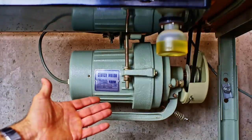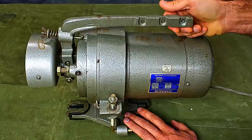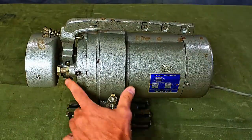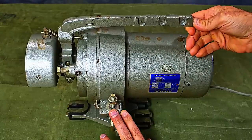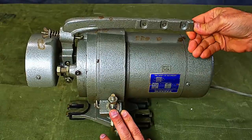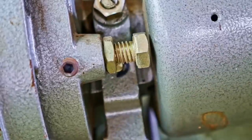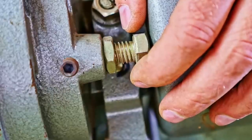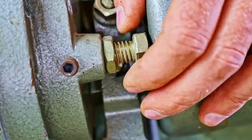Typically they're mounted under the machine in this orientation. So this is the control arm. This is an adjustment for the arm. You can control how far the arm moves before it begins to engage the clutch. So basically it's a stop. I like to adjust that to where I don't move much at all and it starts the machine. I can just set that to where as soon as I step on it, it begins to engage.